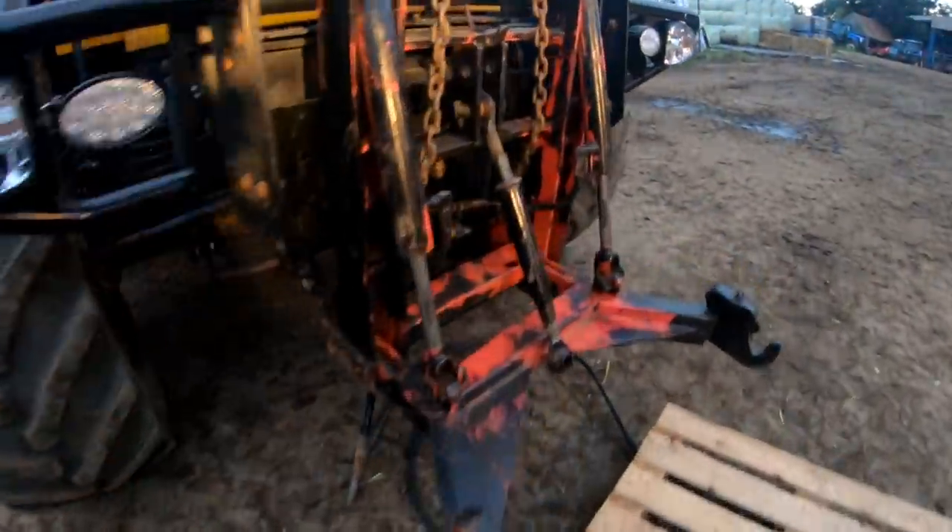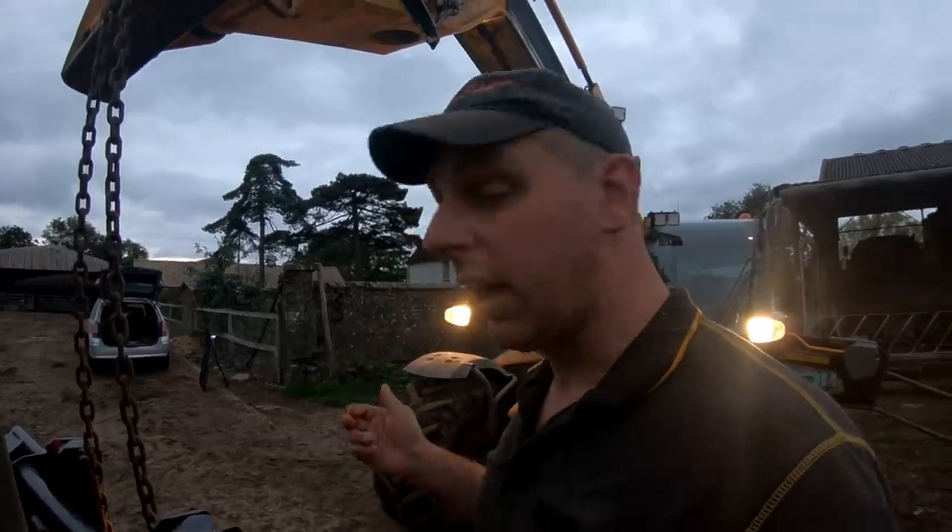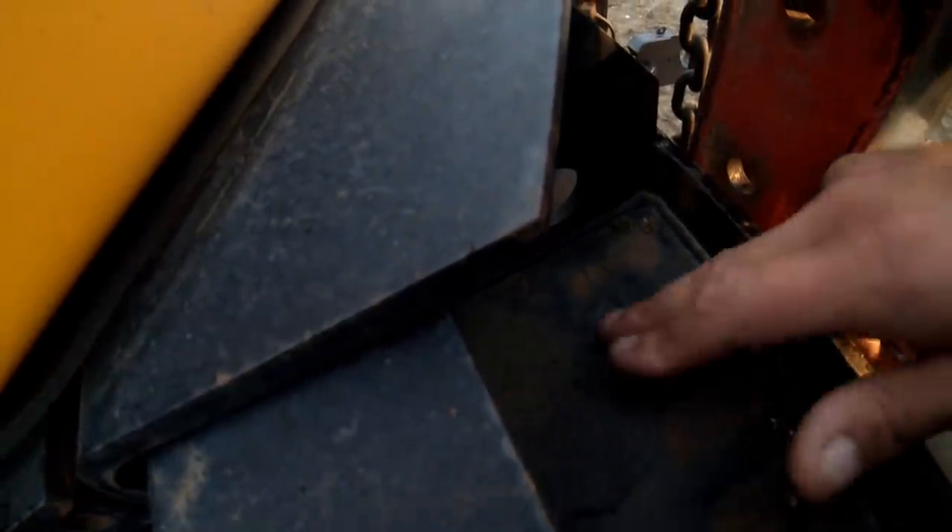Alright, so that looks pretty good, I reckon. That is about where I want it. I've got a load of bolt holes on the back of there and I think that's about the height I want it. I've measured it compared to the T7 — obviously that's got front linkage — so I roughly know the operating range I want. Basically, if I get the mag drill out and drill a hole through there, brace this up with some bits of steel just to make this bit of steel here stronger so it doesn't bend, weld that in. Get that hole bolted in there — and there's one in there as well, you probably can't see, it's a bit dark. Drill that through as well with the mag drill, so that'll be bolted twice there.